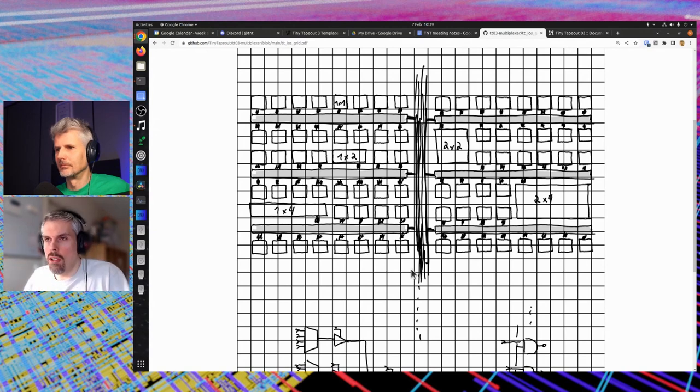The general idea is to have a spine architecture. In the center you have a giant vertical spine carrying all the input and output signals directly. Those connect to some horizontal blocks. The spine itself — the vertical one — is just wires, there is no logic whatsoever at the top level.